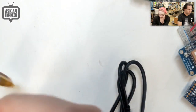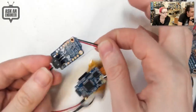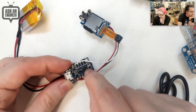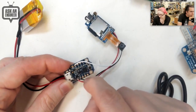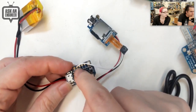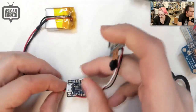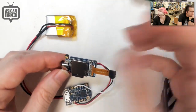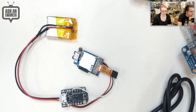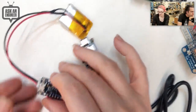So to make the time lapse, what I did is I took the spy camera and I cut that cable. And we'll do a little write-up on this. We just connected the 3-volt, ground and power lines to the Trinket, and then the white wire to GPIO 0, soldered in the connector for a LiPo battery, and it just takes photos every 15 seconds. Although I had it on and then the battery died, so maybe I'll grab another battery really fast in a minute.